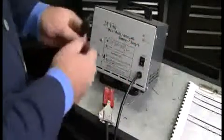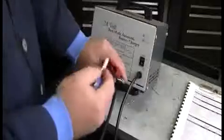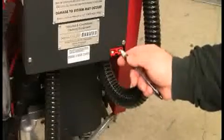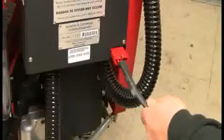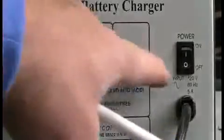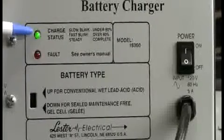When inspecting your battery charger, check the AC plug to confirm it is in proper working condition. Also pay close attention to the ground terminal to ensure it is in good working condition as well. Check the red Anderson plug and confirm that the Anderson terminals are not worn or damaged. Check the opposite Anderson plug located on the back of your MiniMag and confirm that this plug is in proper working condition. Note: if your machine has an onboard charger, it will not have this plug. It is important that your charger is an original equipment manufacturer charger designed for your MiniMag. Check that your battery type switch is set to your type of battery pack. Before turning the charger on, always have the red DC charger plugged into the machine first, then turn the charger on accordingly — doing so will eliminate any possibility of sparking.